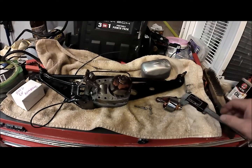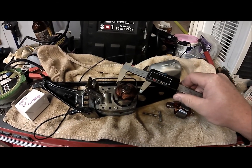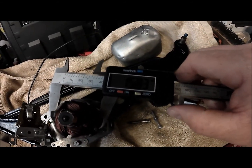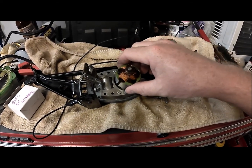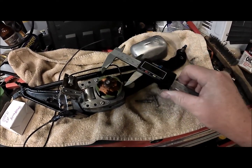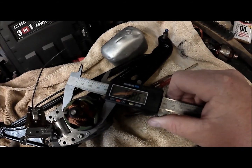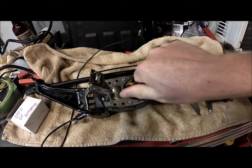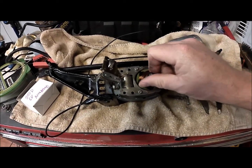I'm going to show you there's a measurement difference between these two. We're going to take our calipers — this one is 1.583. This one measures 1.586; like I say, I've already machined this one down. What you're going to find is if it is too large, it will have a binding spot — you'll hear it scrub a little. I've already milled this one down and it's clearing pretty good.